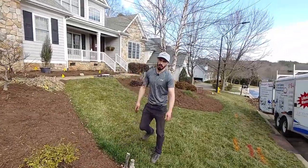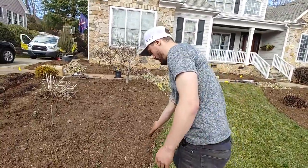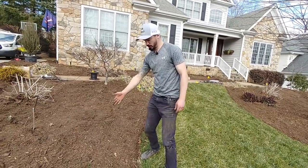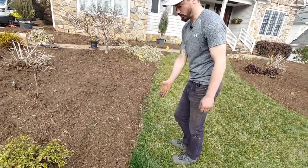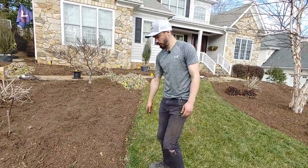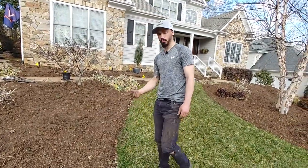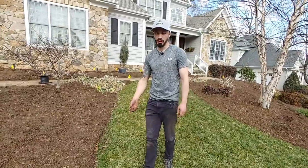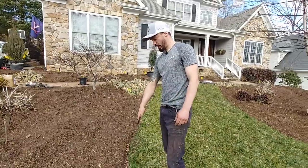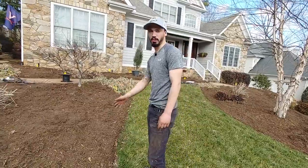If you're doing garden edges like on this bed, a lot of times a landscaper will come past and hit it with a garden edger to make a nice line on the mulch. What we'll do is put a piece of conduit so that if they do cut pretty deep, we have protection for our cable. Usually it's a bright white conduit. Sometimes I'll even put a little colored e-tape on it — yellow or red — so that when they do hit it, they'll see it and stop before cutting our landscape lighting line.